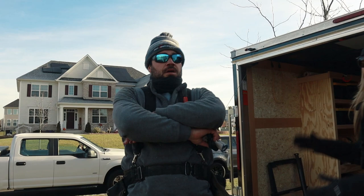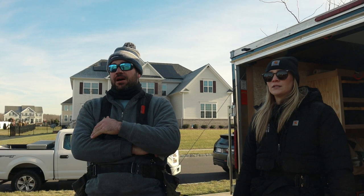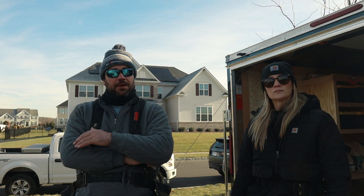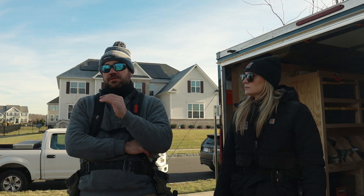Good morning, Catherine. What's the game plan? It's a big day — we're down a man, a very important man. Sean is out today, so we're getting this roof up without him. The game plan is: we're going to get the ridge set first. Then I'm going to get the guys set up, pulling layout on our beams, prepping our rafters for our show rafters. Some of the rafters have to have the tails cut off because they're going to butt into the bump out of the house. Once we get all that prep work done and setups are made, that's what really helps the rafters just fall into place and fly.